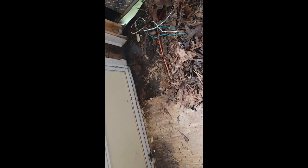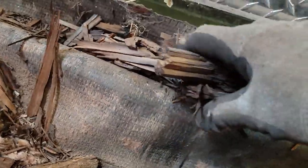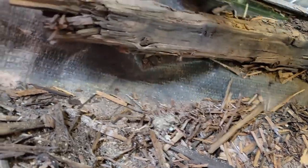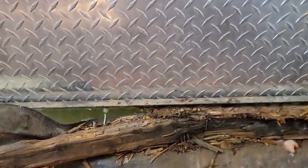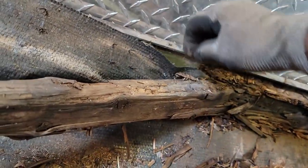I'm going to have to replace all that. I'm not sure how much more I'm going to have to tear up, but I'll tear up some more and come back when I get a little bit more done. Let's take a look at this board down here — it's just falling right apart. This lining on the bottom is there to keep moisture and stuff from coming up, but in this case it helped trap the moisture. So we're just going to have to start pulling this off where it's stapled or something.